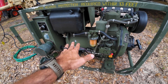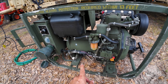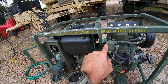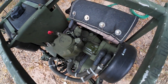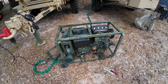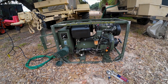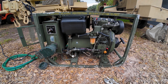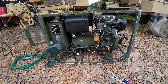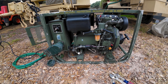When you shut these down, if you've been running it for an extended period of time, you should give it like five minutes of cool down without any load on it to let the stator and everything cool down. There is supposed to be a quarter inch return line that runs to the injector that I did not have on there — you could see from when I was priming the system some of the excess that came out. In a nutshell, if you just got one of these and you're having trouble priming up the system, that's it with some extras. These are pretty simple machines, but if you do want more videos on these series generators, let me know in the comments. I've also considered starting to carry some parts for these on my store — let me know if you're interested. Thanks for watching, and if you found it helpful, leave me a comment.